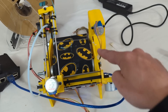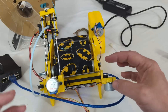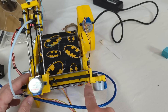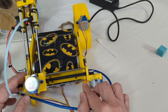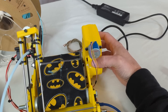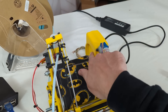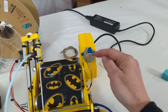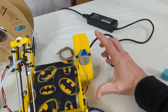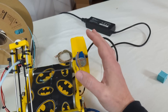You can see a couple of dabs of other colored filament on the printer — that was my attempt to fix what was funky, as this got damaged in shipping. These little ears holding the guide rods for the X axis had one snap off, so I used my 3D printer pen to make a little goober to hold it back in place. Over here you can see the flex on the housing for the motor transmission — it's a big 3D-printed worm gear in there because this little motor doesn't have enough torque. The belt doesn't need to move quickly so it's a great solution, but the housing kind of flopped back and forth, and I needed to tack it in place to get the print to work.